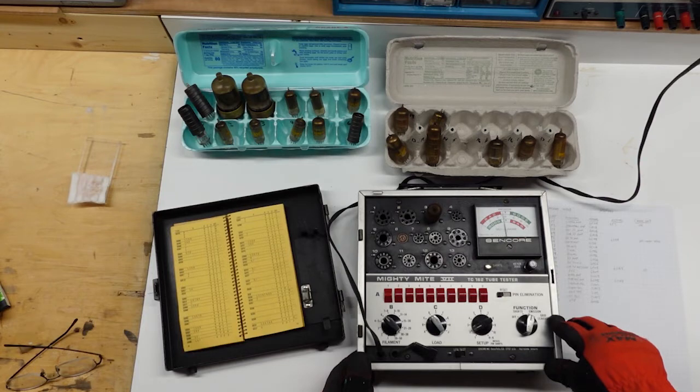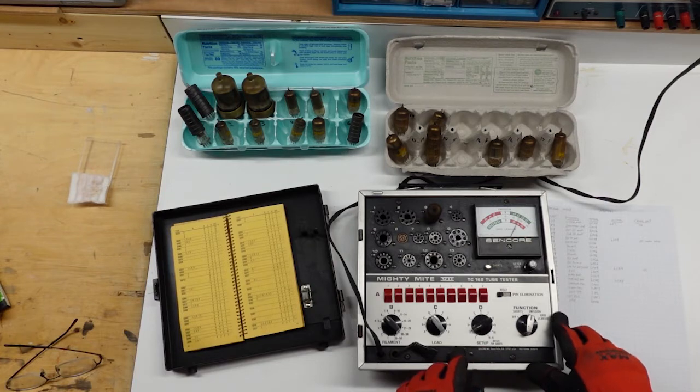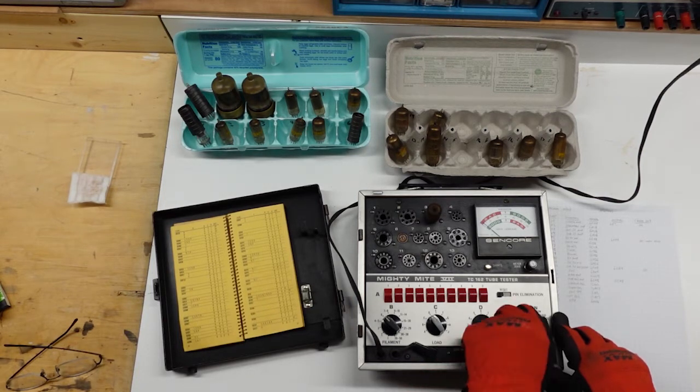After going through all 20 of them, there's only one that was a hard fail for shorts and for grid leakage. Unfortunately, it's one of the two 6HS-6s. Those are hard to find and they're expensive — they're north of $40 a piece anymore. But according to a quick internet search, the 6AH-6 and even the 6AU-6 can be substituted in those locations with little consequence, and both of those are more readily available and not that expensive. I have a lot of cleaning and inspection ahead of me, and that'll be the subject for the next video, along with the list of repairs and restoration that I'm going to commit myself to on this radio. So thanks very much for watching this first of what should be several videos on a repair and restoration of an HW-101. Until next time, bye for now.